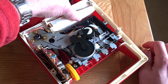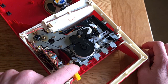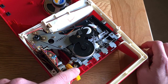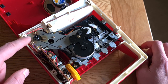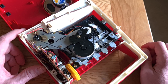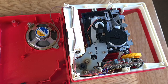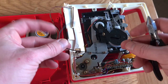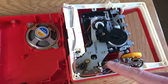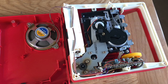It's still playing away. It's only got six volts in it so we're pretty good with that. It is playing very slowly by the sound of it. So I can also do with finding out how to adjust the pot on this motor — which could be anywhere. Good luck finding a service manual. Strange one. First of all, let's change this belt. I found a belt in my stock of handy belts for various tape decks. What I'd like to do is pull this board out, take this metal cover off, and try to find a pot for that motor because it sounds a bit slow.